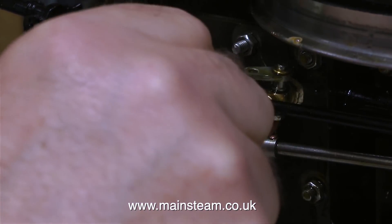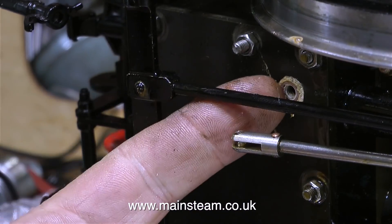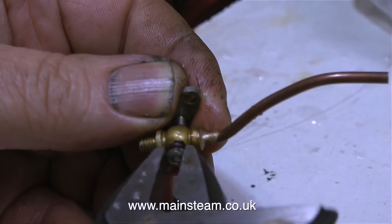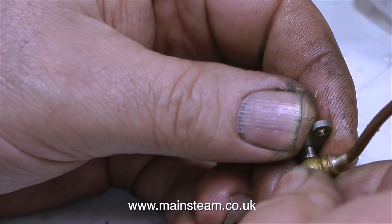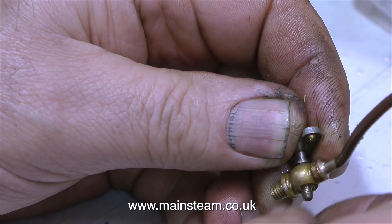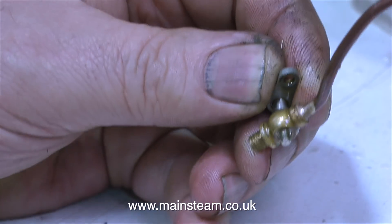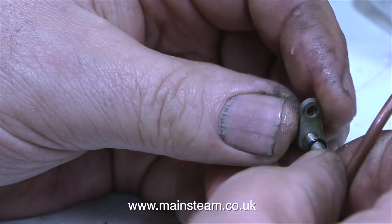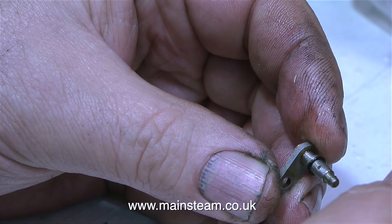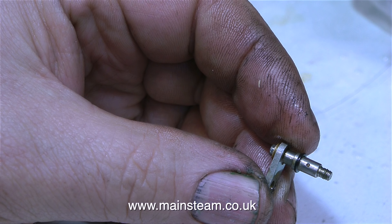The first thing I had to do was straighten out the pipe, then very carefully unscrew the tap. Now the idea of a steam locomotive is that it has drain cocks on the end of each cylinder to prevent hydraulic locking. But because of the design of this engine, there's one drain cock in the steam chest — and this tiny little drain cock has a hole through the middle that I can hardly see without a magnifying glass. And the hole's blocked; there's a lump of swarf in the middle of the hole.